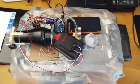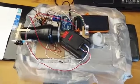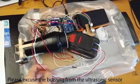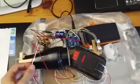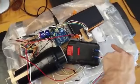Here's an overview of my wiring and setup. I've used a 20-volt battery from a drill I already owned to save money. I did have to use one white wire where I wanted to use red because I ran out of red wires, and these supply power to the two relays, which distribute power to my thrust and lift fans.